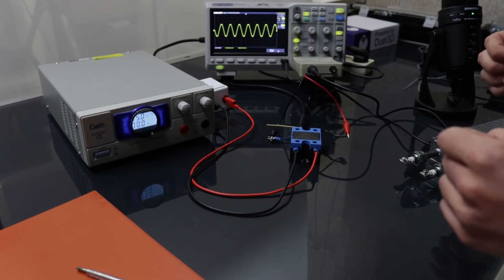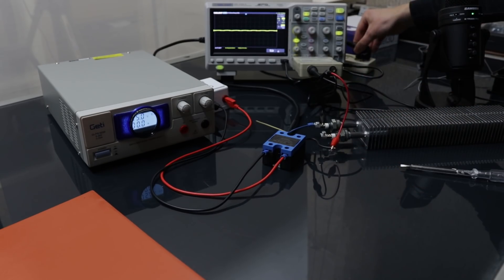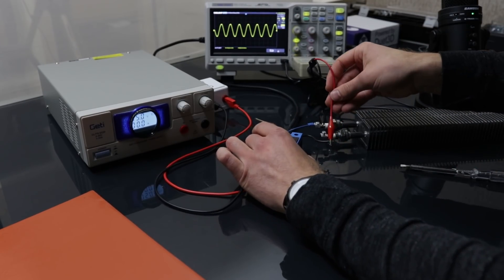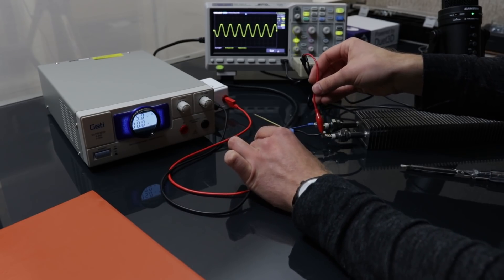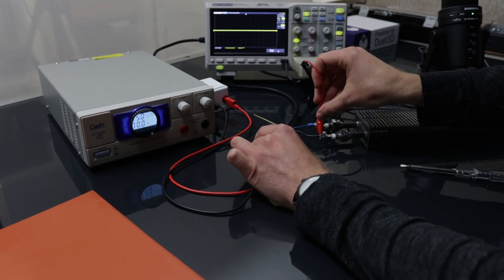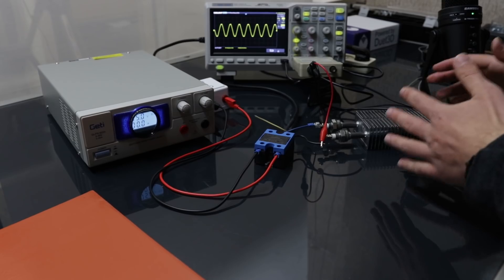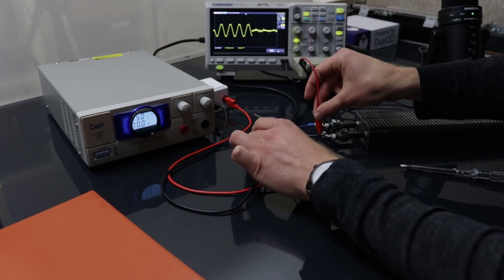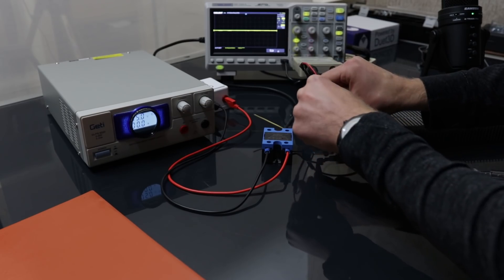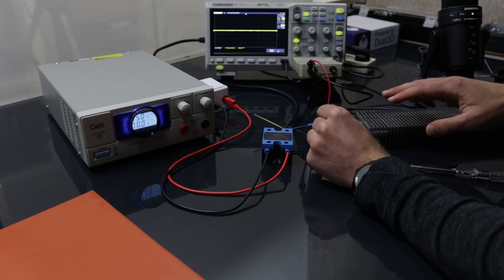To demonstrate the next thing I'm going to connect this heater. Now I've connected the neutral to the heater and this is still the same - so it's still floating. When I plug in the cord, 230 volts is still on here. This is still off by the way. When I'm going to touch the heater with this wire over here, look at the screen - the voltage goes away. The heater isn't turning on of course, but now the whole 230 volts is across this relay and not to this heater. The impedance is pretty low because it's a 1 kilowatt heater, so it drags the 230 volts down - a little bit of current is flowing through that heater. And when I'm going to switch it on, this heater is going to heat up.